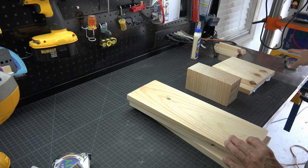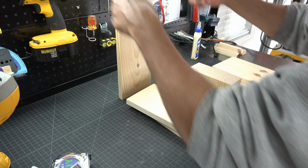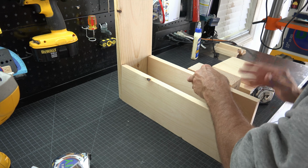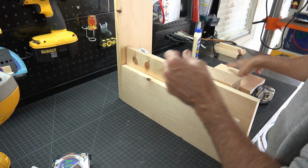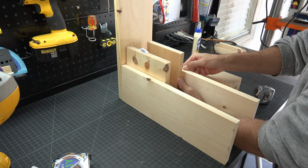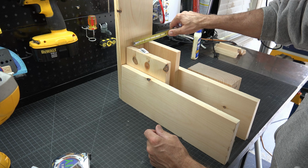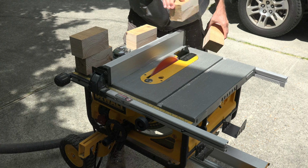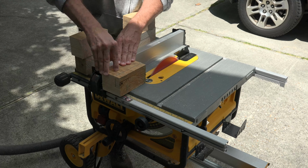Okay, let me take you into the mind of John and tell you what I'm thinking here. I see the first piece going all the way across. I'm picturing this from a side view. And I will have boards going across and spaced the same distance as the base. So I will need to know what this distance is between those inside cross pieces so I can fill them with support blocks in the center and both top and bottom. I take that measurement and I cut the blocks. I will need a total of 6, 3 for each side.